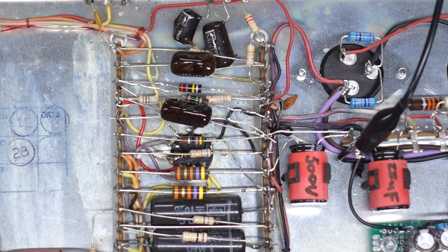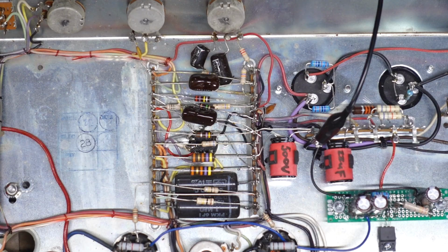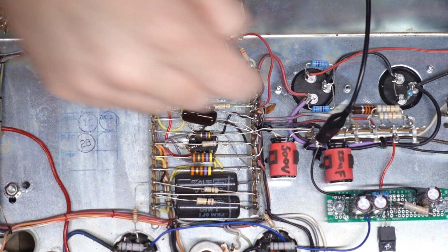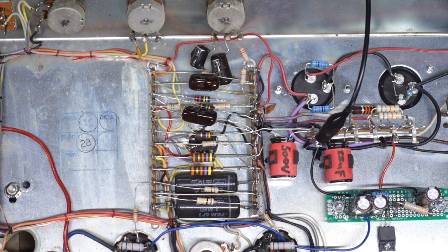It occurred to me that where I used a pair of dual 100s, I could have used dual 50s. The only reason I didn't is because I didn't have them in stock. Well, you know what? I've got a couple old Marshalls, but I'm not gonna put old caps in here. Either way, you could use dual 50s, and then this would theoretically split down to a 25, more in line with the spec they're calling for there. So if you were gonna redesign this power supply, I'd opt for dual 50s, not dual 100s. And then these other guys, these 22s here are just fine. Not gonna call BS on that.